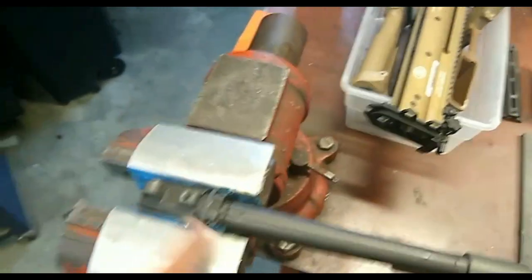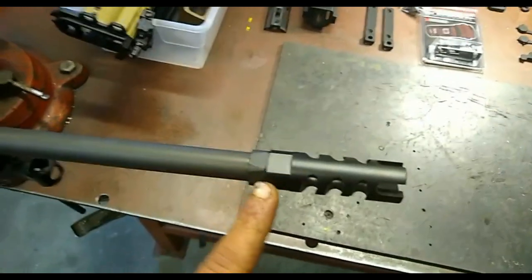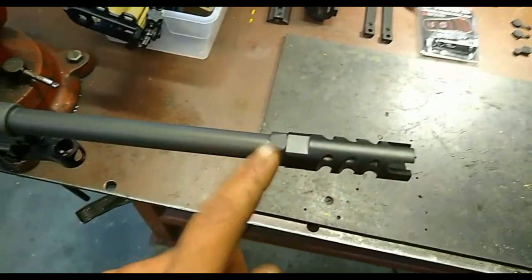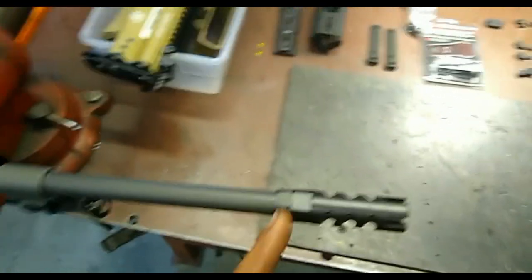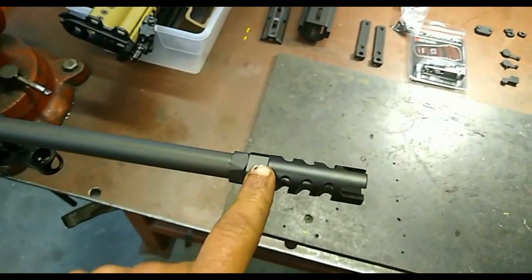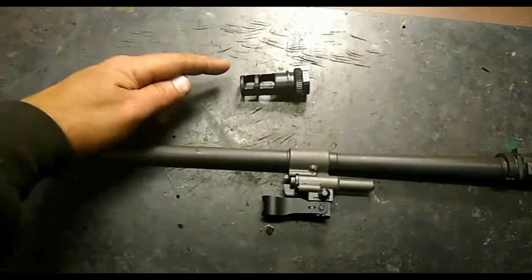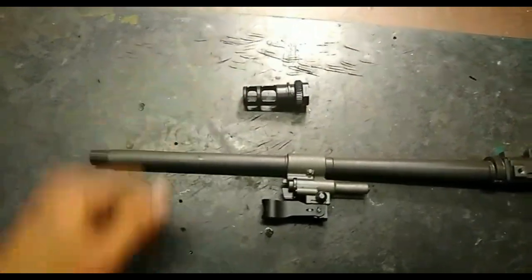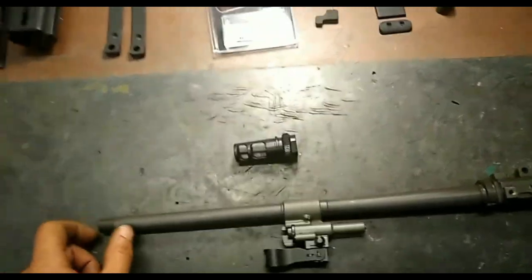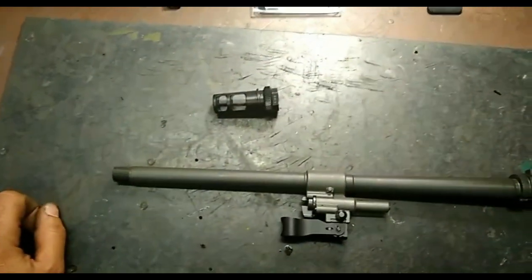Now that I've got the rail removed and adjusted the rear barrel, the next project is to remove the muzzle device. Per the armorer's manual from FN, the tightening specs on this are extremely tight, so you're going to take two wrenches, hold the jam nut and the muzzle device flat, and turn them in opposite directions. The muzzle device is now removed. Since Nick is running an AAC suppressor, this is the muzzle device he's opting to use. We are going to maintain a 16-inch overall length on this, so this barrel's going to be cut, re-threaded, re-crowned, and then pin and welded with this muzzle device at 16 inches overall.